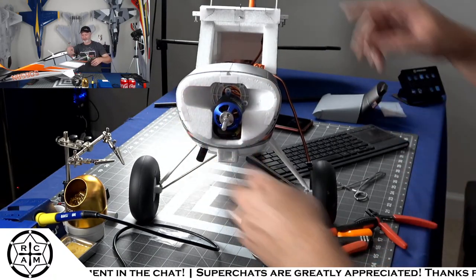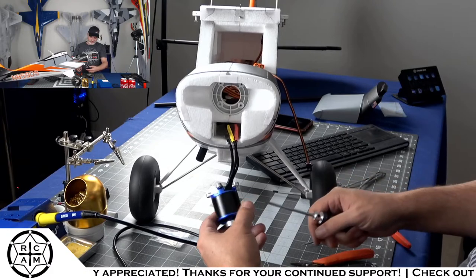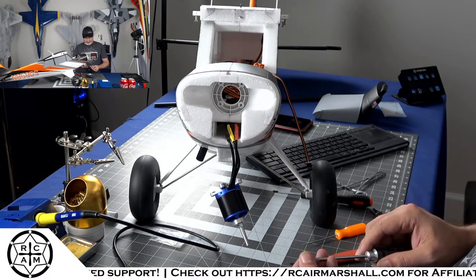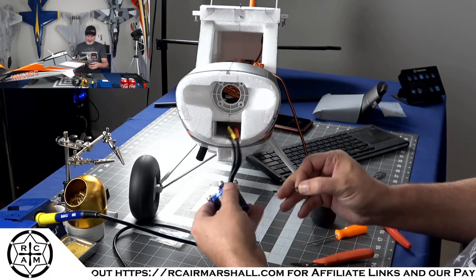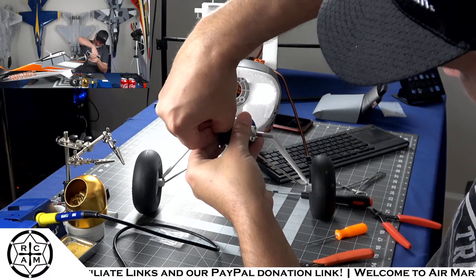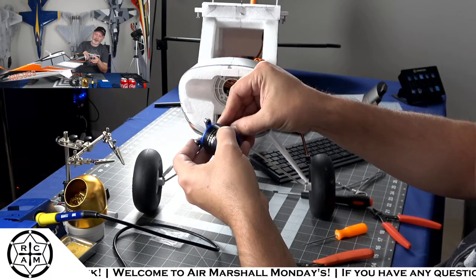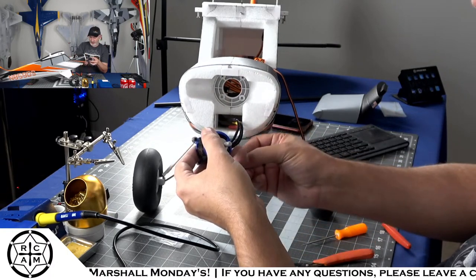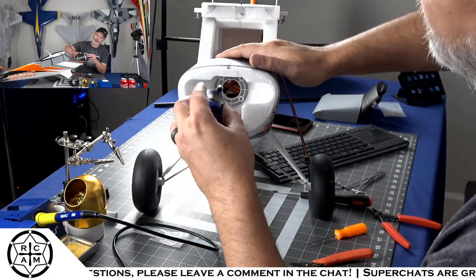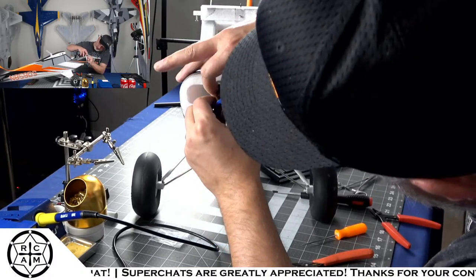Now we've got the ESC and the battery cable pulled up into the battery hatch area. And now we can go ahead and get the motor remounted. And I remember those screws being a little tough to get out of the X bracket. So what's funny with this is they put a much bigger motor in the spot of the old motor. The old motor was, I believe, a 35 size can, and this one is a 39 size can. So it's 4 millimeters bigger, but they had to use the same size X bracket, which makes things a little snug.